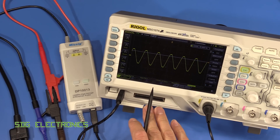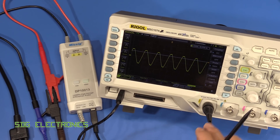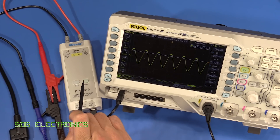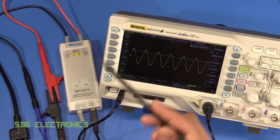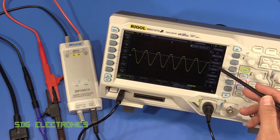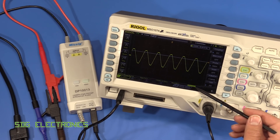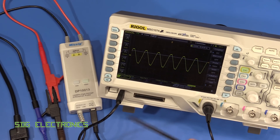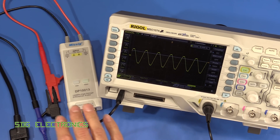The configuration to use it with your oscilloscope is really quite straightforward. If you've got an oscilloscope like this you can literally just plug it into the USB connector on the front to power it and into one of the inputs with the BNC connector. I've set this to 500x attenuation — on any modern scope you can set the attenuation to a whole range of values, and you set it to 500x so all the scaling in your measurements is correct. You can see here it's reading an RMS mains voltage of 240 volts — nearly 250 volts — which is accurate. I'm probing the mains directly, not creating any hazard, and I'm able to touch the BNC connectors without getting an electric shock, so it's doing exactly as claimed.